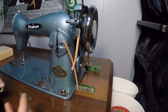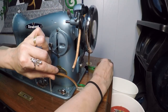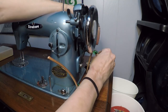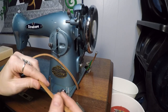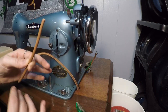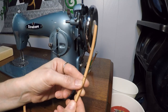This is the part I really struggled with the most. The easiest way to do it is simply let the belt be slack — let it flow over and give yourself plenty of slack. Yes, you're going to have to completely get the belt back in the right location, upper and lower, but it's so much easier to pull the belt out of that little narrow niche-y area and get it over to a place where you can actually support it on your block of wood.